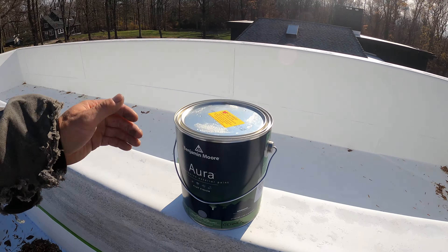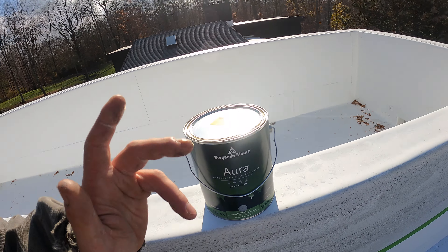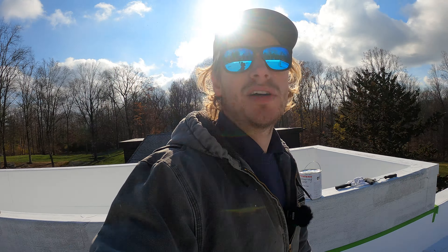The paint we're using is Benjamin Moore Aura, and as far as I know that is the best paint money can buy. I applied it about 10 years ago onto a building that had really bad siding — had a gallon left over from a job. The building wasn't doing so well anyway, cedar shake siding was falling apart. So I just threw the gallon of paint on top even though there was mold — I didn't power wash, clean, sand, or anything. I barely scraped it and just threw the paint on. The paint looks better now than any of the other paint done on the building because it's really high quality — it hasn't chipped, peeled, or anything. It went straight over everything and it was beautiful. Now it is very expensive as paint goes, but honestly I really have a hard time beating it because it is so nice.